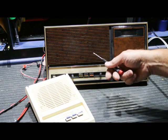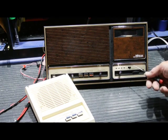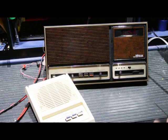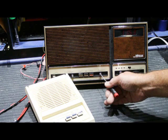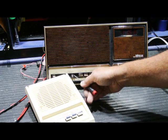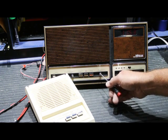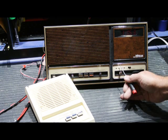All right, some time has passed and I've rebuilt Don's IM3003, so let's power it up and see what we have. You'll notice I have the program volume set at a little lower than half, and I have the master speaker volume set at full. Both of these controls have been cleaned and lubricated so they'll work better than when it showed up. And if you listen carefully — no more hum.